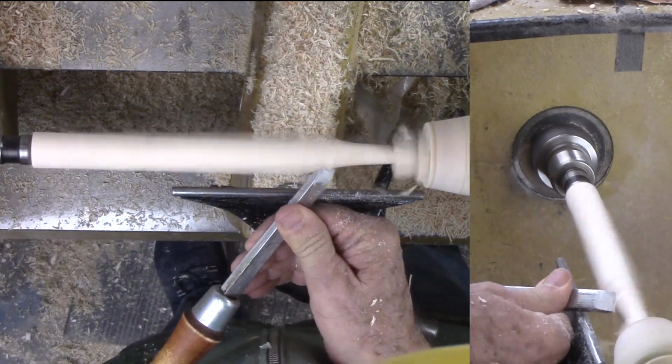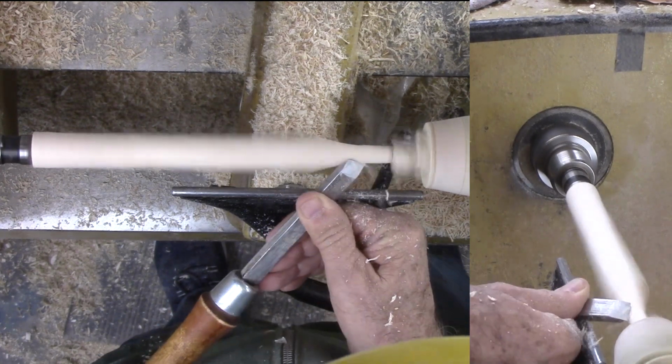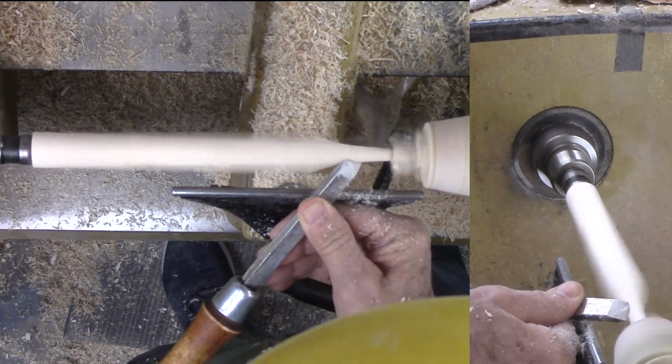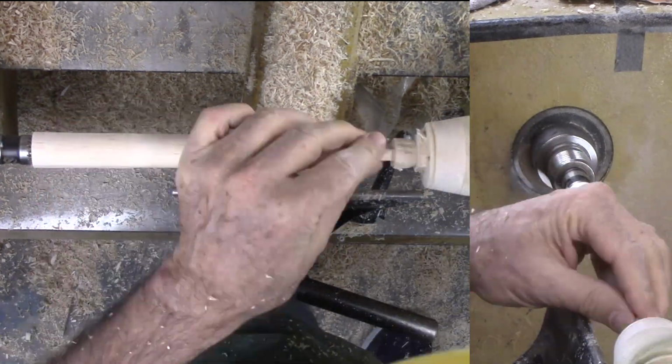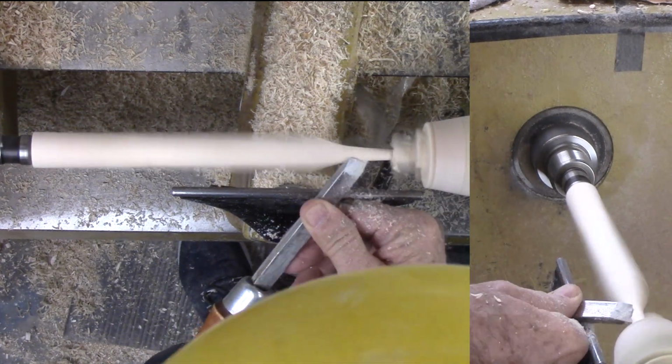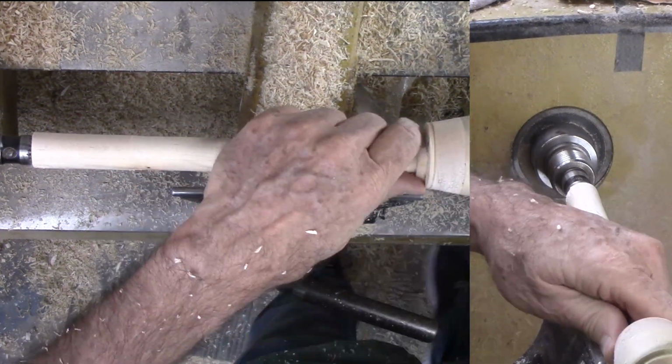While roughing, I mentioned not riding the bevel hard. This is also the case now. With the offset, the action is the same with gentle cuts to form a cove. I am done when about 1/2 inch is round with a taper down to that point.